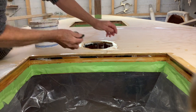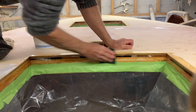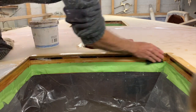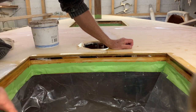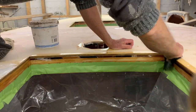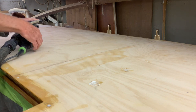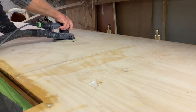There were a few other jobs to do before sheathing. All the exposed edges around the deck edge and hatch openings received two coats of epoxy to seal the end grain — if this isn't done, the end grain draws the epoxy out of the sheathing cloth leaving it dry. The epoxy was scoured to remove the amine blush and sanded. The scarf joints were checked for fairness, any bumps planed off and any hollows filled. All fastening heads were also filled and the whole deck was sanded.